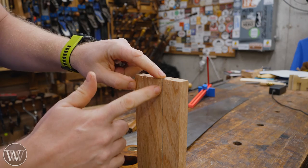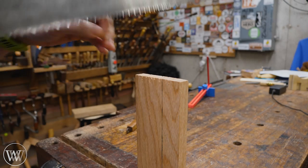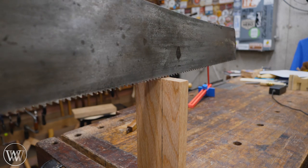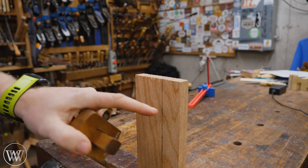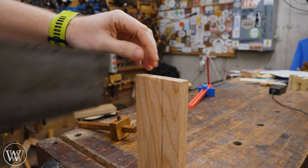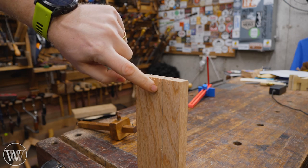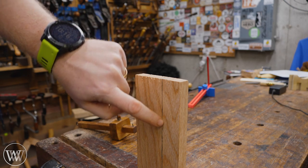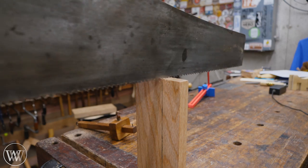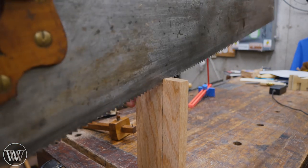Now the tricky part — we have a line we want to follow all the way down. I have to ask myself: do I want to split the line and put the saw right down the middle, or do I want it on one side or the other? Normally with a marking gauge line I have a very fine line, but here I'm using a pencil so you can see it. I'm actually going to put the saw on this side of the cut so that the line ends up being the very edge of the kerf. I'll position it with my thumb, let it slide, and then when ready, let it engage and start the cut.